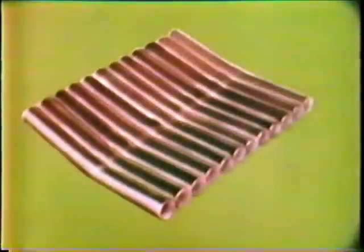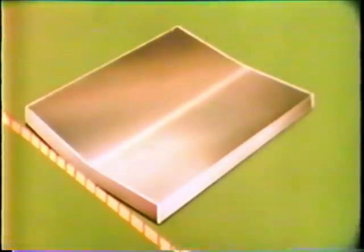In other words, there was no control, and the final result is distortion. Now several steel bars side by side is much the same as a steel plate, showing that uncontrolled contraction always causes distortion.